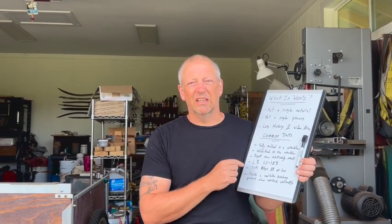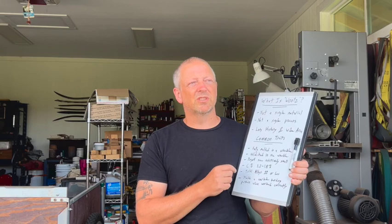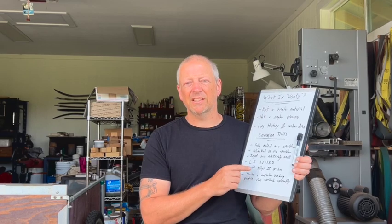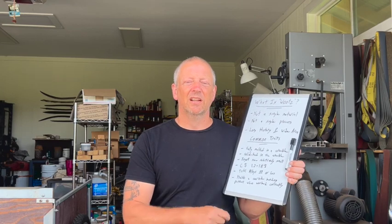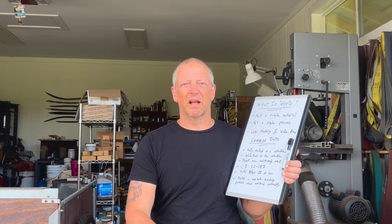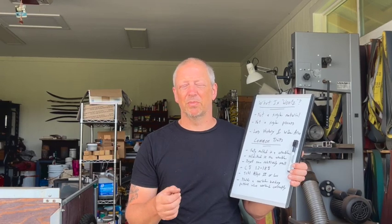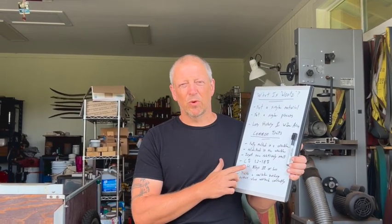And this is also key. These were very simple steels from an alloying perspective. Wootz historically would have had a total alloy content of less than 1% by weight, and obviously I'm not including the carbon content in that. We're talking other elements like phosphorus and nickel, copper, and obviously things like vanadium, niobium, chromium, all the carbide forming elements. Silicon, another one that's pretty much always going to be in there. But all those added together would be less than 1%.